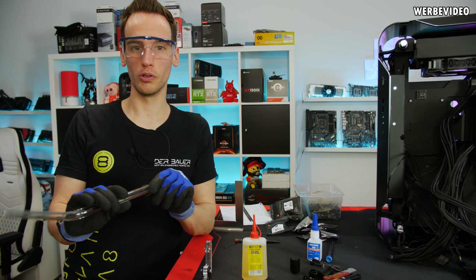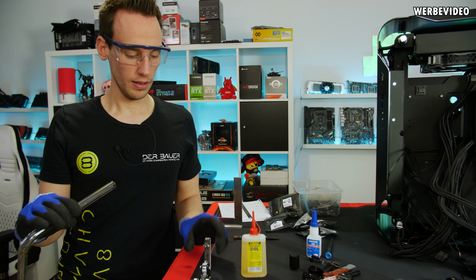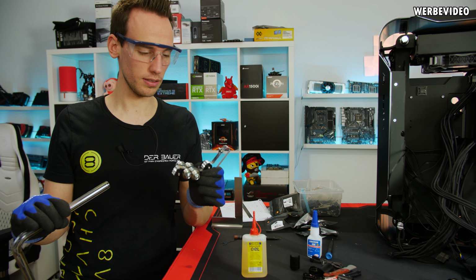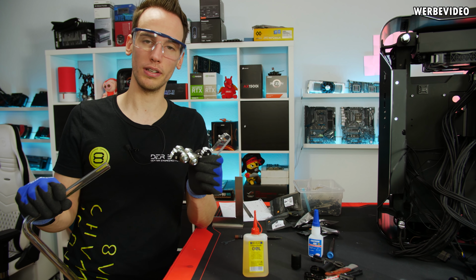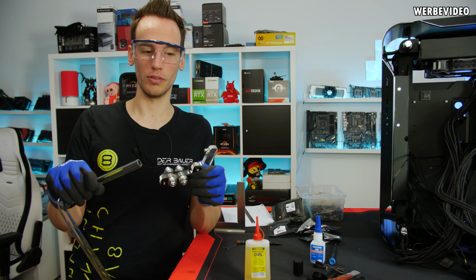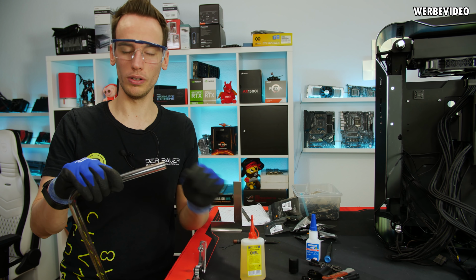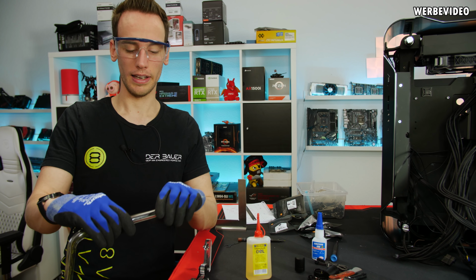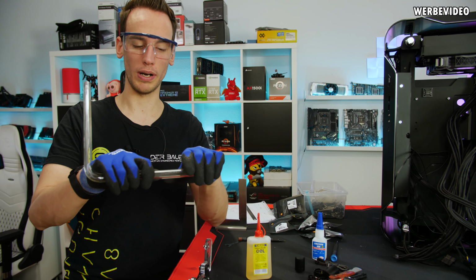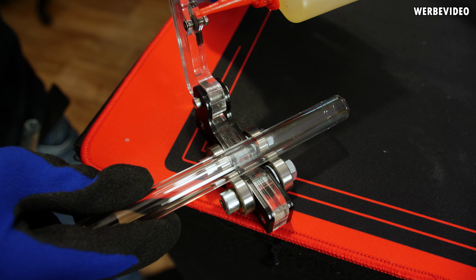I also made some good progress in learning how to cut those glass tubes properly. In my personal opinion, the glass tube cutter, which we made ourselves, is still the best way. The only thing that I had to learn is not to cut 360 degrees, more like 270 degrees is pretty good. Use a little bit of oil, only scratch it slightly, and the movement is also quite important. The movement has to be not only break it, but break and pull apart, and that's pretty much it.